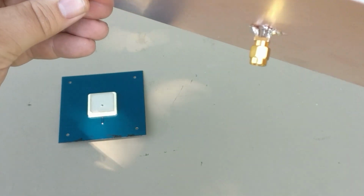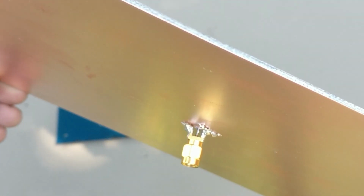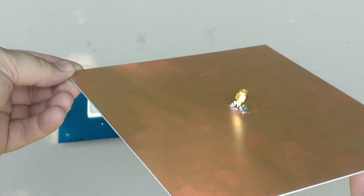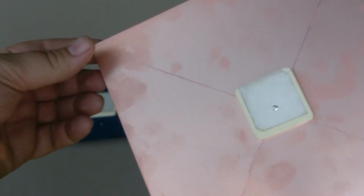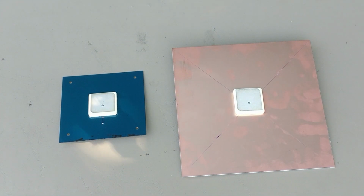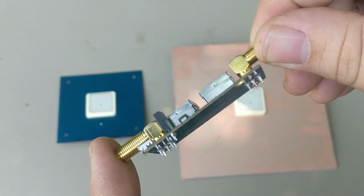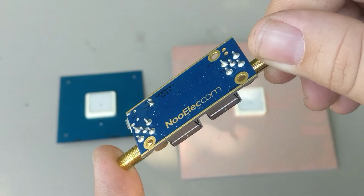On the right we have a double-sided copper-clad PCB that I've placed my own ceramic patch onto and very dirtily soldered an SMA to the back because the panel mount SMAs I was waiting for have not yet arrived. Eventually, I would like to make this an air gap patch antenna, but because I had a ceramic receiver on hand, I thought I'd give it a try. However, to use my particular antenna, I'm going to need a third-party LNA, such as those provided by Nooelec.